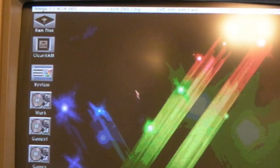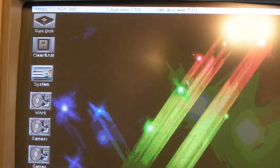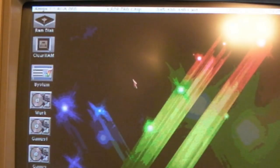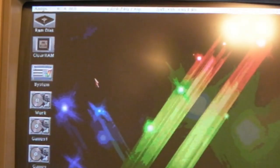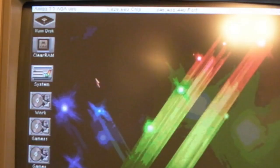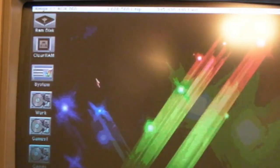It works now. There we go. I have fixed a mouse with a bodge, and my bodge was successful. It's got this linearity issue you can sometimes have, and this is where the sensors just need a slight tweak. I'm just going to move the other one away a little bit. Yeah, bend them in and outwards. There we go, perfect now.